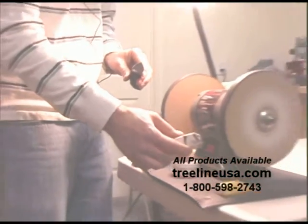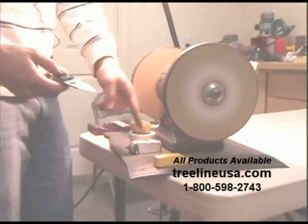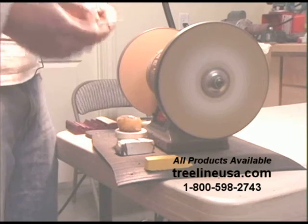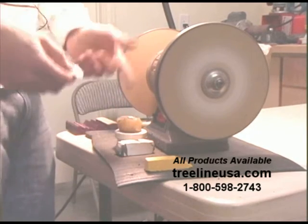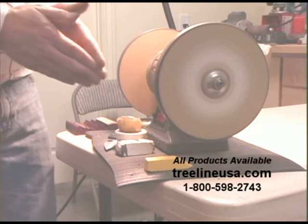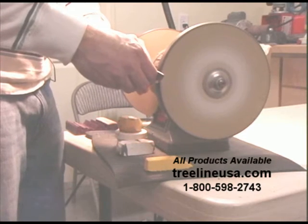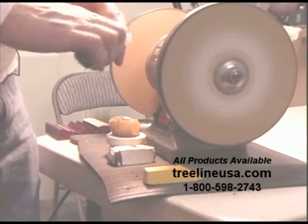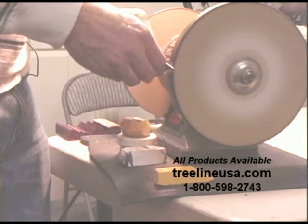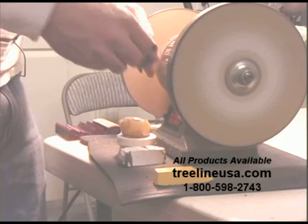So I'll come over to this other wheel and charge it with a little bit of polishing compound. There are several compounds on the market — it comes with the white rouge and that's what we'll use. Flexcut makes the Flexcut Gold, you can use that. I've seen some other people use green compound. Just check your results — the white has worked great for me. Now I take it going side to side, because what we're trying to do is take off that wire edge, taking it back and forth until it gets thin enough and falls right off. Holding at the exact same angle, I go from one edge all the way to the other. Around five or six times on each side will normally give you a plenty sharp edge.